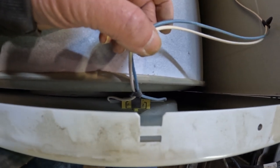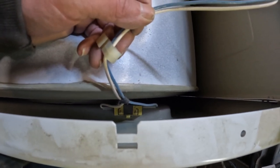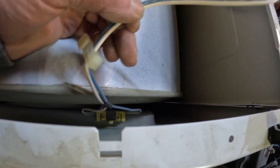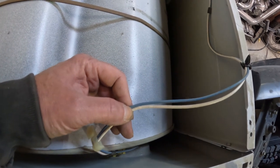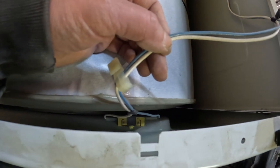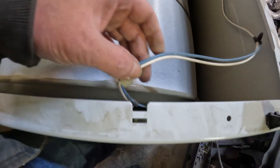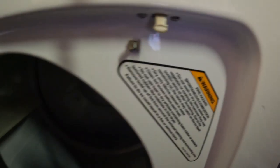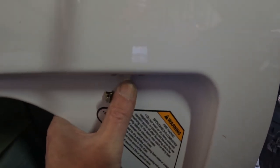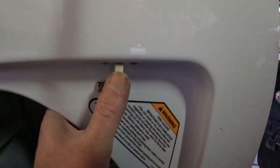Since we're not going to have a door, what you do is disconnect that switch and then splice these two wires together, and that'll give you a closed circuit instead of an open circuit without the door. Basically with the switch right now it's an open circuit, and then with the click it's a closed circuit — so now it would actually work.